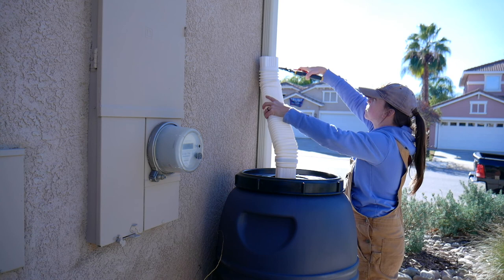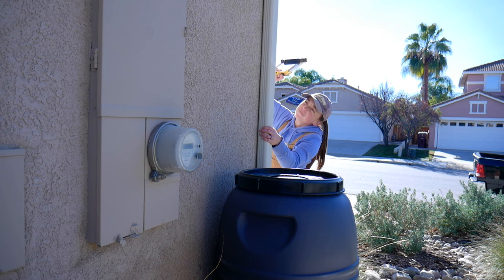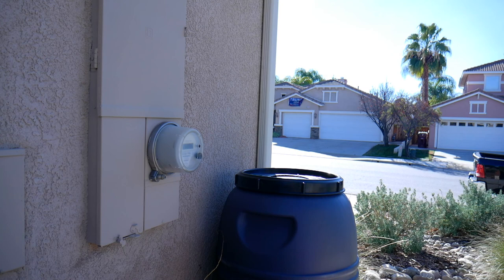With the line marked, I went ahead and started sawing the downspout. I would definitely recommend wearing safety glasses and some gloves because there's metal involved. I didn't — I should have, my bad. Just get it started with the saw because the sound is so bad. And then once you have a hole big enough, go in with the snips and just start cutting away.